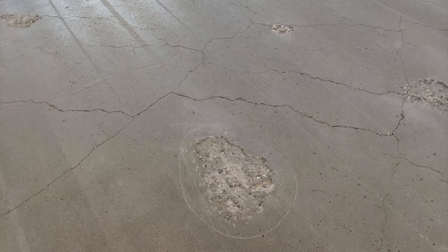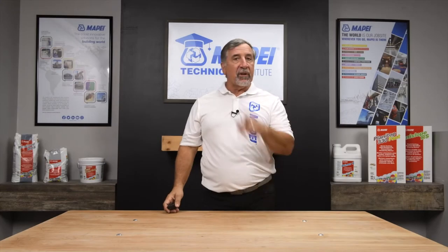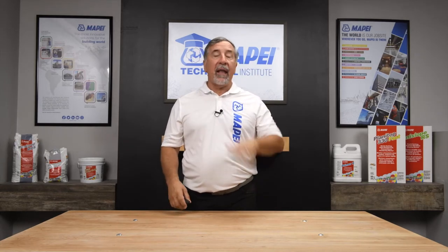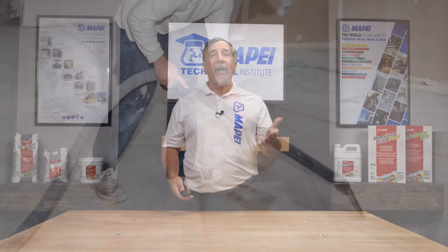What do you do when you show up on a job like that? There's cracking on the surface — hopefully that cracking isn't all the way through the concrete, because if it is, you need to gently back off and run. This slab is not ready for you to install anything on top of it. Then you have spots where it's blistered and come up to the top. First, figure out why it's cracked. Then patch those spots — we have the product for that.